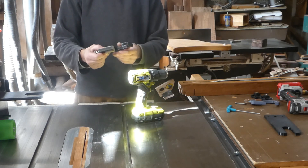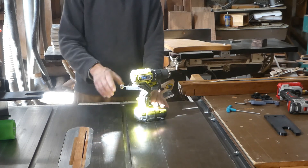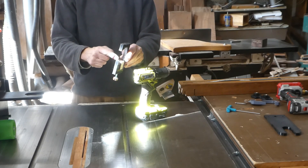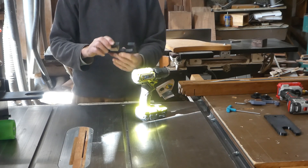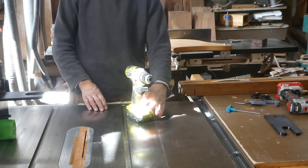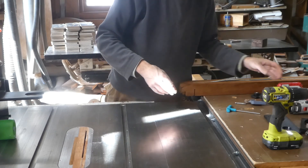The key here is to make sure that the distance is short enough that you can have a fully off position with it perpendicular. You should be able to turn it off by swiveling, and by virtue of the bevel in the block and the deepened corner, there should be a position where it will be stable in the off position. This works for the majority of the drills I've tested, though there are some outliers.